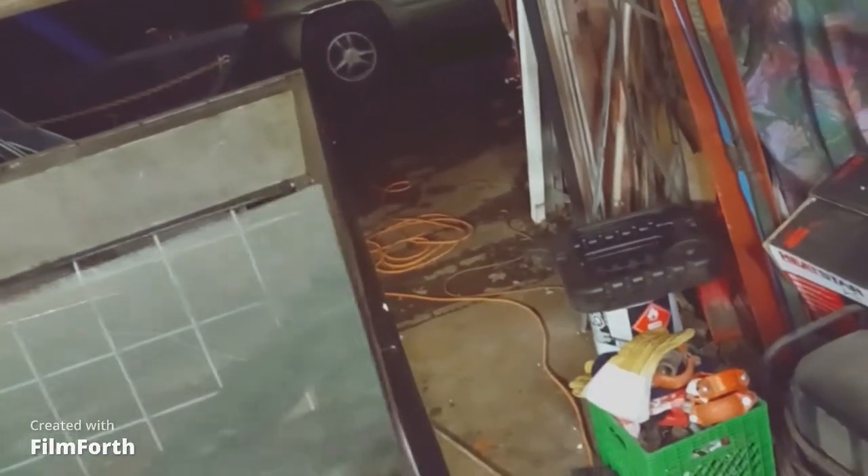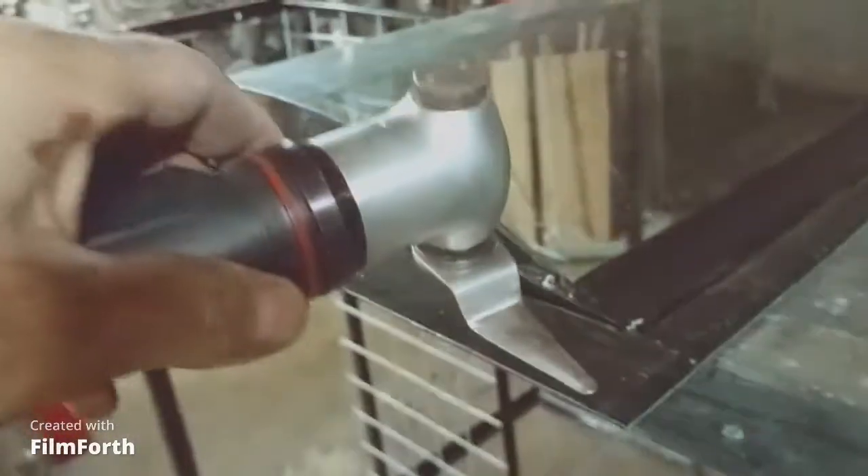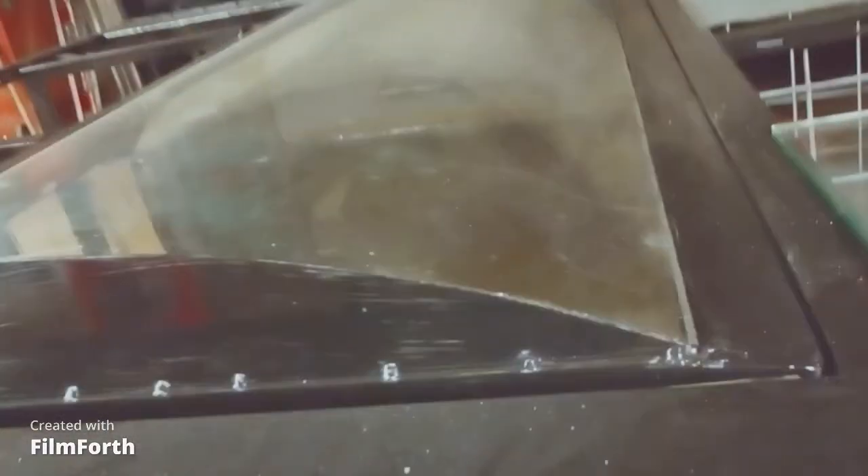Here's the glass I'm putting in. I'm going to be cutting it to size and bonding it right on the angle iron frame with windshield urethane — automotive windshield urethane. If I ever need to replace a pane, I just use a pneumatic tool that cuts underneath the glass and shears off the old urethane. Then I cut a new piece of glass, run a new bead of urethane, and glue a new one back in. I welded a piece of stainless steel on top here.